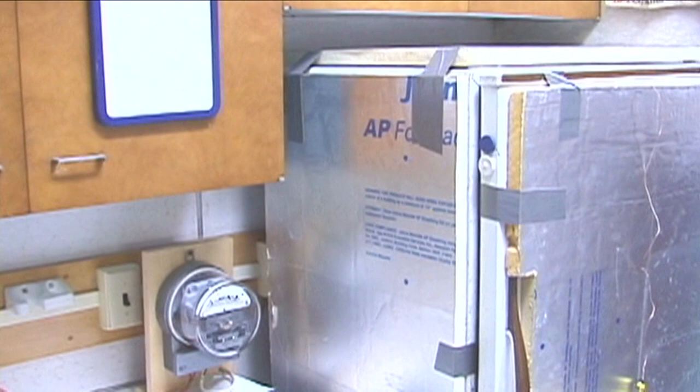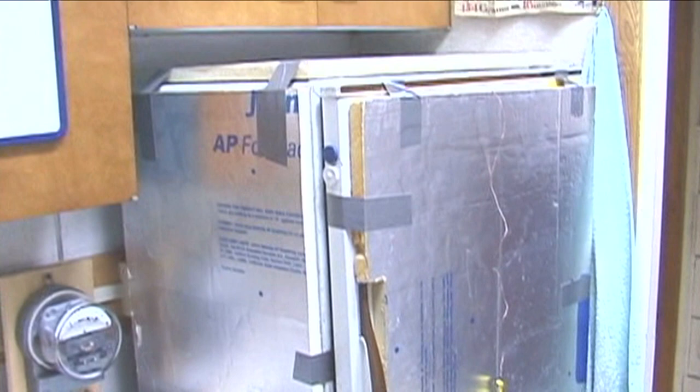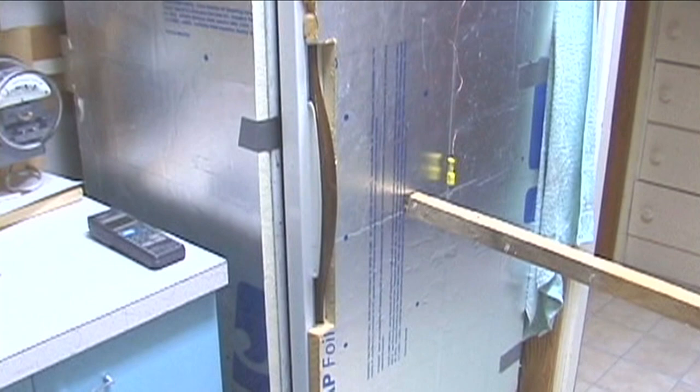But when you realize that there are 100 million households, and if the electric rates were the same, this is $10 million a day. That's with at least one refrigerator. Your household has three, right? Well, no, there are three households, the way the Census Bureau counts households. The next thing is that if you multiply 100 million times 365 days in the year and 8/10 of a kilowatt-hour per day, you come up with 30 billion kilowatt-hours. And that's four big nukes.